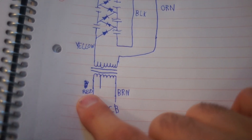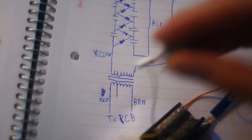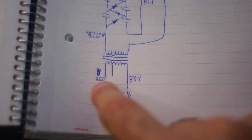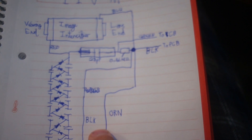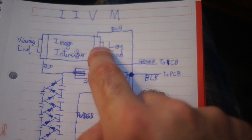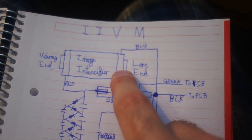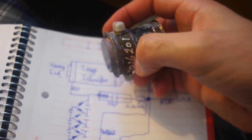What we have here is the red and brown wires on the connector, which go straight into the transformer primary. The secondary is the yellow and orange wires, one of which goes all the way up and connects straight to the lens end of the tube — the positive end — which is this bit of metal here. This tube only has two contacts, so I don't even know what generation it is, because I think they go up to about Gen 3, maybe 4 now.